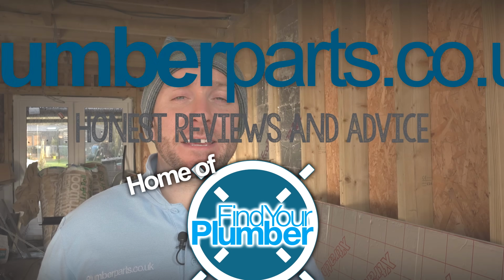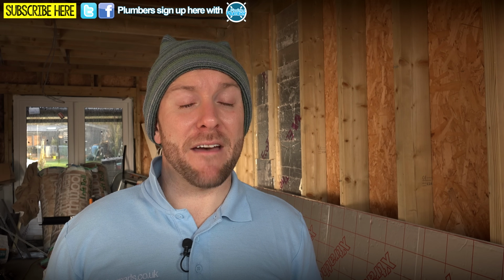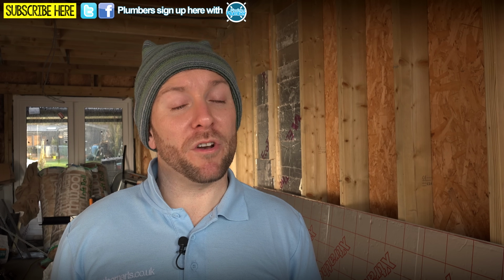So what we're looking at today is how to install pipework inside timber joists. Now I had a look around on the interwebs about this, and there's not really many great videos about it. Most of them are from America, where the regs are slightly different, because there are regs that you need to think about when you're doing this sort of thing. If you want it crossed off by building control, they're going to come out and have a look at it, and they're going to want to see that your pipework's been installed properly. It might sound a bit mad that drilling a hole in a bit of 7x2 timber needs regulations, especially if you're only putting a 15mm pipe through. But they are there, and you do need to follow them if you want to get this stuff signed off. So let's have a look at how to do it.